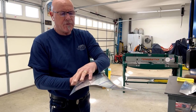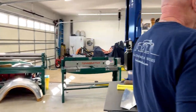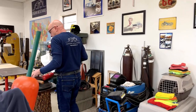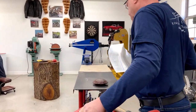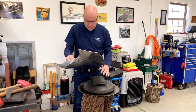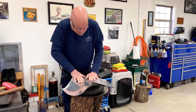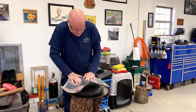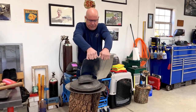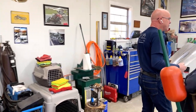As you can see, the panel has come over considerably on this end, which is way too much, so I'm going to need to pick that back up. Let's see how this part of the panel has come in now. I'll utilize the lead shot bag just to help me get that back into shape without damaging it. Just got a little manipulation to go. We'll put a little bit of a hollow in it, but that's okay — we can pick it up in the wheel.